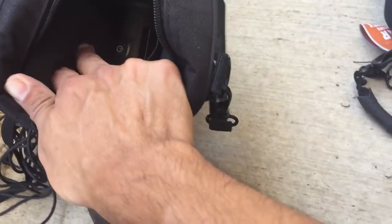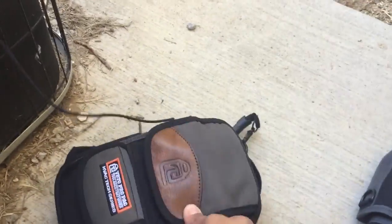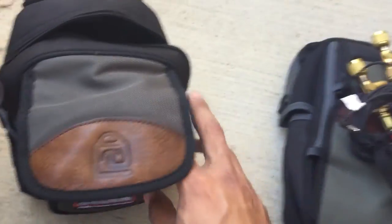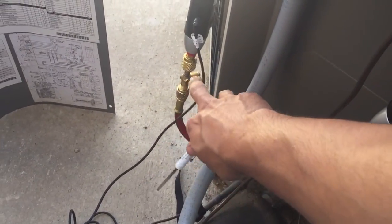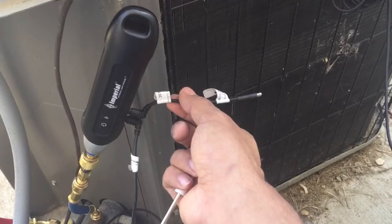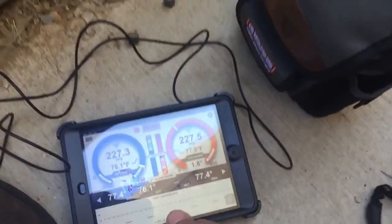Make sure I turn it on. It's hard to see but I can see the lights on. I keep my probes up here — low pressure, high pressure. I can put everything in here but I keep my airflow probes in this bag. Let me hook everything up. Alright, I got my high side, got my liquid line temp, my low side suction line temp, and then I got my little airflow probe. Since I'm in the shade it should work pretty decent to get my outdoor ambient profile of the unit.